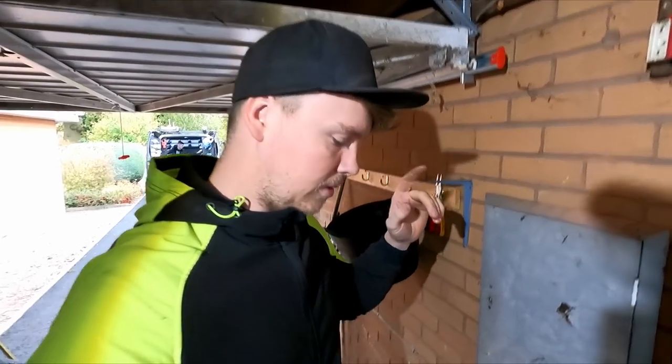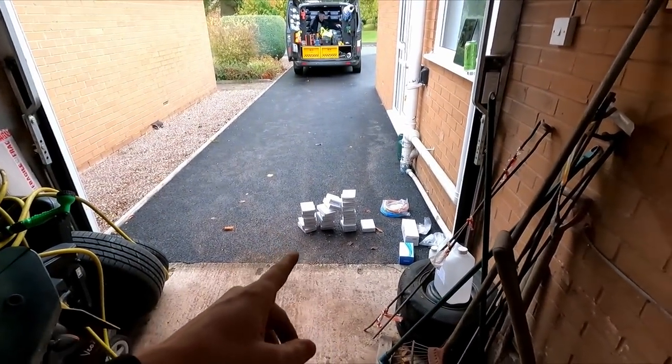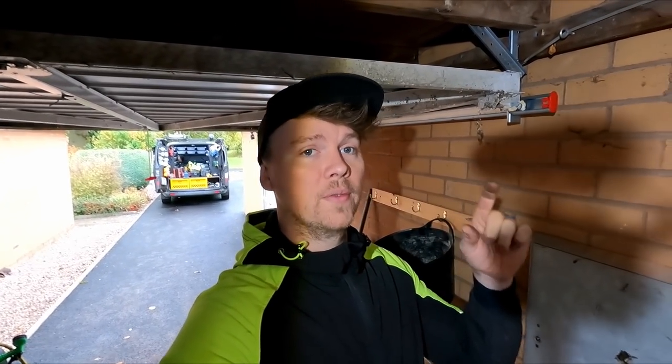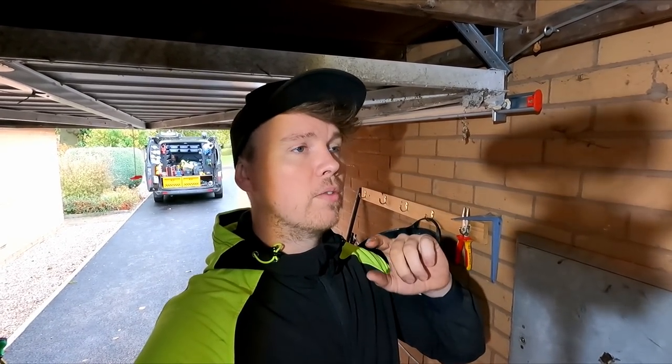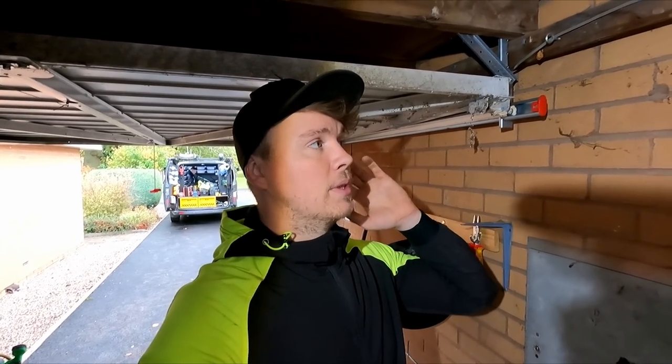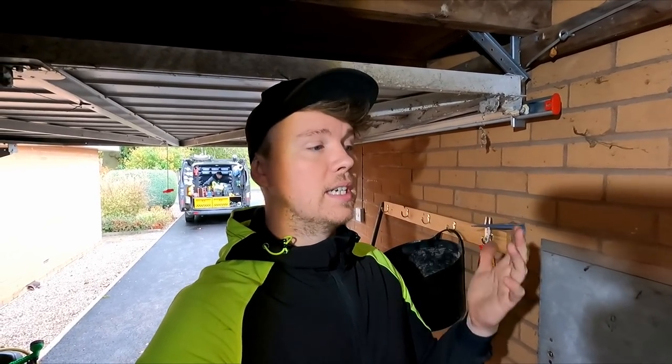We'll get this off. Adam's just set the RCBOs up, everything. What I am going to do, so a KMF switch, for the younger lads that don't know a KMF switch, it's a main isolation switch with the fuse in it. Normally if you run main tails more than 3 meters, you need to fuse it down to 60 amp because of the length. If it's within the fabric of the building, the tails, you need to RCD protect it.